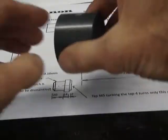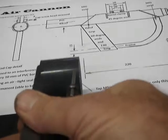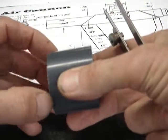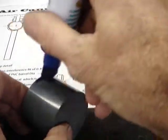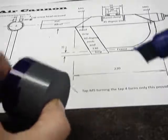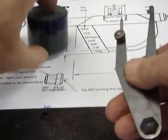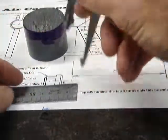The total length is 36 millimeters, so we've faced off one end and now I want to make sure the total length is the finished size. Ideally we'd put it in the lathe and use the odd-leg calipers to mark off 36mm, but there's not enough left over to hold it in the chuck — you'd be holding it with about 2 millimeters, which is not going to work. So we're going to get our big bold blue marker pen and put some ink around the side where we want to put the scratch mark. When we marked out the barrel clamp we used engineers' ink, which is messy because of the squirter bottle container — this marker pen is a much better way of applying it.